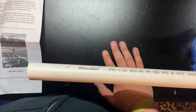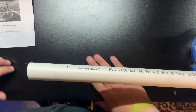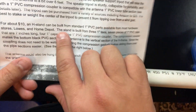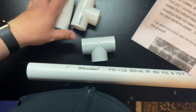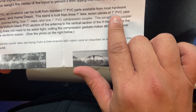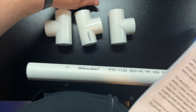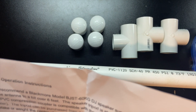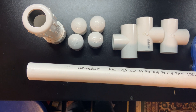For today's DX 101 from the workbench, we are putting together a little PVC stand for a portable version of the W6LVP loop, which we have on order for our DX-expedition to the Outer Banks. This is the parts list printed from the W6LVP website: you have seven pieces of one-inch PVC pipe, each seven inches long; four one-inch caps; three T-connectors; and one one-inch PVC compression coupler. That's it — the instructions show exactly how to put it all together.